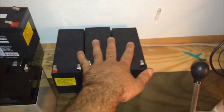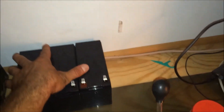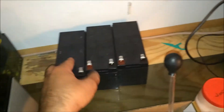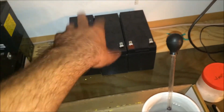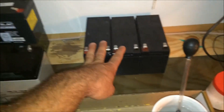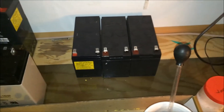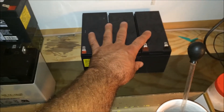Here's the workbench where I've been doing it. You can see these are 7 amp-hour sealed lead-acid batteries. I get these for free from work in the recycling bin, and a lot of them turned out to actually be bad, but many of them turn out to just need a little bit of water and a little desulfation and accept a full charge. So that's one pack — 36 volt, 7 amp-hour.